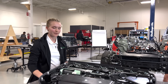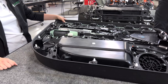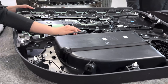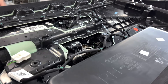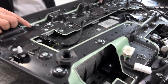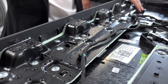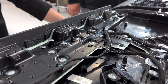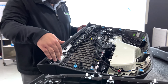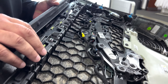The first thing to point out is that there are a lot of screws — 120 screws exactly on the driver's side of this car, and the passenger side matches. They use screws in some interesting and unusual locations, like two screws less than a centimeter apart securing the same assembly near the door handle. Up at the top, there are three elevated screws securing the NVH noise and vibration canceling panel, which is atypical — you'd normally see heat staking or heat welding there. On the Tesla, there are hooks molded into the panel that the NVH panel simply clips over.